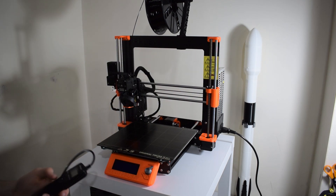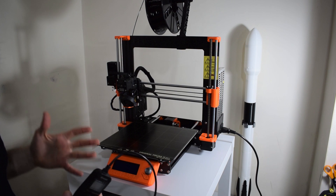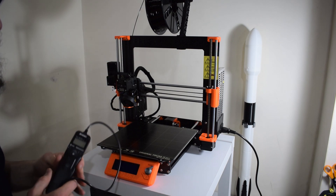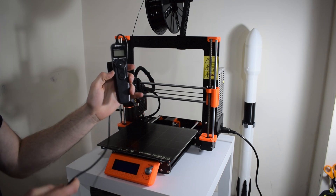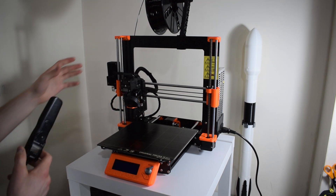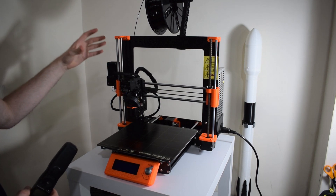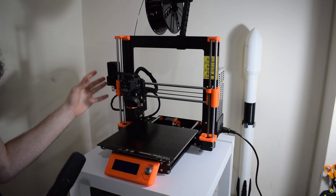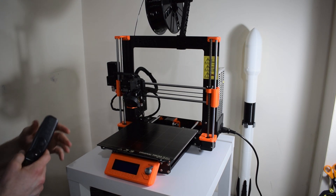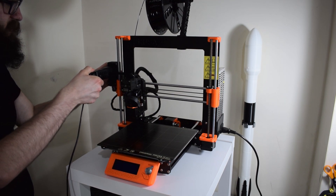I decided the best way was to keep everything on the X-axis — that way you're always in line with the shutter because it moves with the X-axis. I'll put a link to the shutter in the description. I created a piece that mounts right onto the X-axis motor holder — the original Prusa part — using longer bolts that go through and bolt into the motor. The shutter slides straight in, nice and simple, and it's really firm.